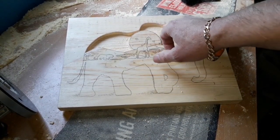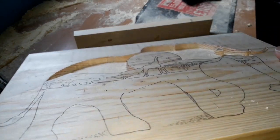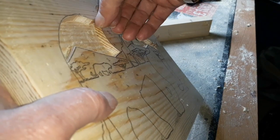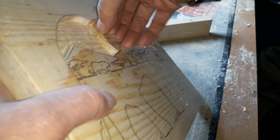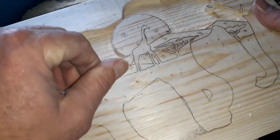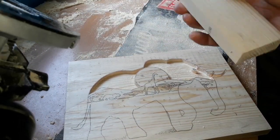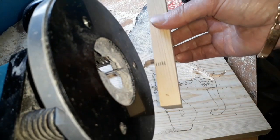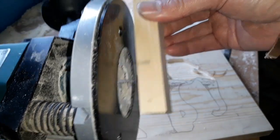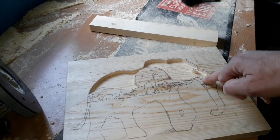That's the fives all cleared out — quite deep enough, as you can see. Hopefully that gives enough depth to play with, because remember we've still got to do a four, a three, a two, and a one. Can't go too shallow. We've moved the router bit up using our little gauge on the side — it's only a rough guideline — so I've gone from five and it's roughly set on four now. Then we'll do the same again with three, two, and one. So let's remove these number fours.